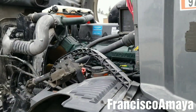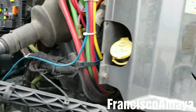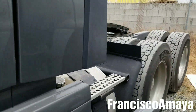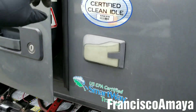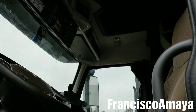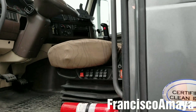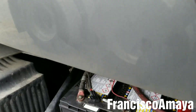This specific Volvo has a Volvo engine, but the engine has nothing to do with the problem we have here. It's very important for all of you trying to figure out problems like this to go to the basics. Right now there is no power over here, so that means there is no power even on those little lights over there. If you push them and there is no power, that means the power distribution center is the one causing that problem, and it starts from the batteries.